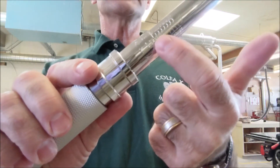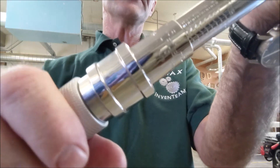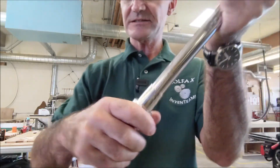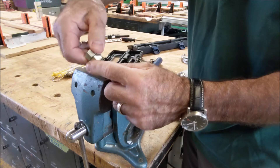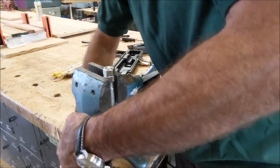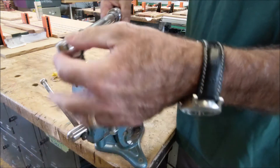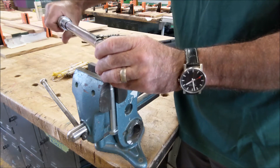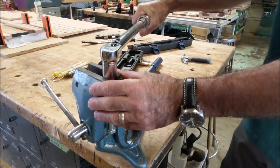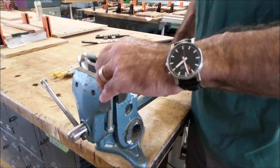If I want to use metric, I would use the Newton meters on the back — Newtons is a force, meters is the distance from the radius. So now I have this torque wrench set at 25 foot pounds. Right here in the vise I have two nuts on a bolt — I'll clamp the bottom nut in the vise, get a socket, and put it on my torque wrench. I'm going to crank it from my hand centered on the handle and listen for the click. That click means I'm at 25 foot pounds of force.